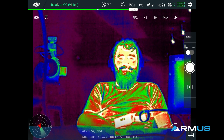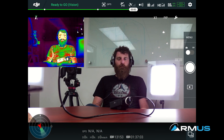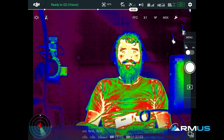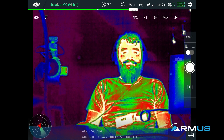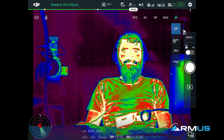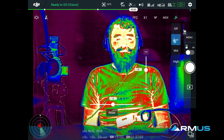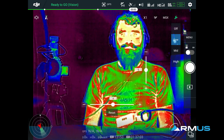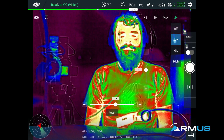The MSX button rotates through visible light, picture-in-picture, and back to MSX. I have that set up on the controller button as well. The little wrench is to toggle MSX on. MSX is the blending of the RGB camera and the thermal camera together — a FLIR-specific technology. If I punch this on low we can see the alignment — the parallax from the two cameras — and I can move the RGB outline just a little bit.